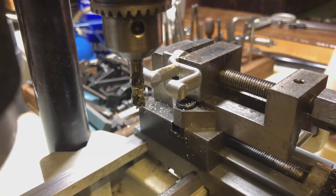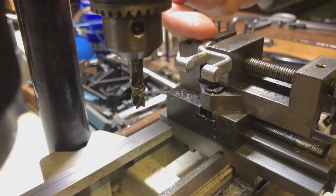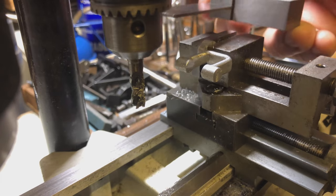I'm just going to bring this back out of the way because now I need to actually measure the distance between this rear face and that point there — that is the distance listed on the dimensions, which needs to be 438 thou. So I need a straight edge — let me get my set squares out, because that's the best known straight edge I have. I don't want a massive chonky one, but that one will do.